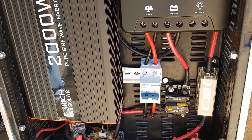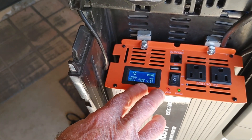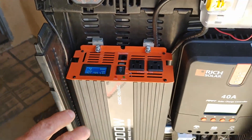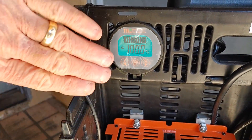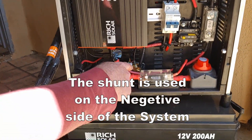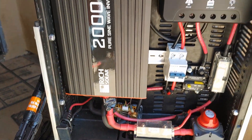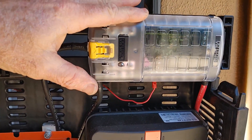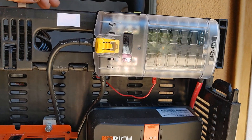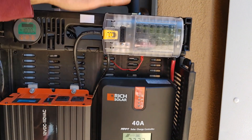I've got the inverter on, so it also shows the input — 13.7 volts, 60 hertz — and an output of 114 volts. When it's taking a charge, this display kind of flashes. This is basically a shunt that shows the power you're using and the power going into it. The shunt is right there, connected up to the top display. We also have a 12-volt fuse area, so you can run 12-volt appliances, LED lights, or whatever you want off of here — it takes spade fuses and has 10 slots.